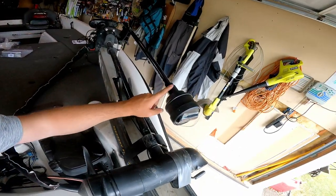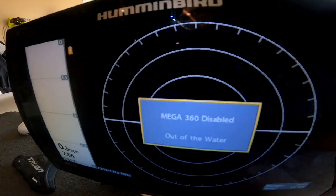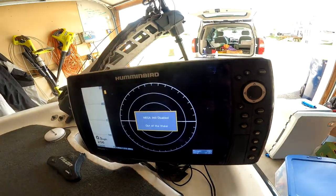The last thing we need to do is tip this down and get the alignment. Basically this round part needs to be in line parallel with the boat - right down the seam - so that's your true forward. That's what aligns your transducers so when you see a boulder, grass patch, log, or brush pile off at a certain direction on screen, you know where to cast. Also it turns out you actually have to have it in water to operate it - there are sensors that need to be submerged or you just get an error message.